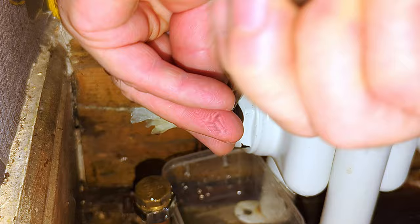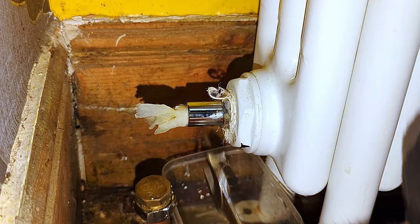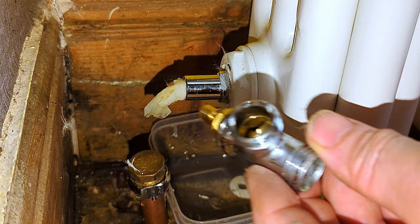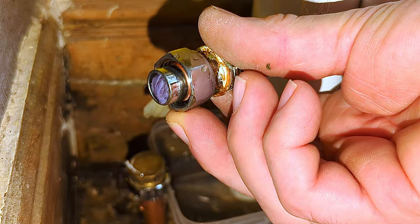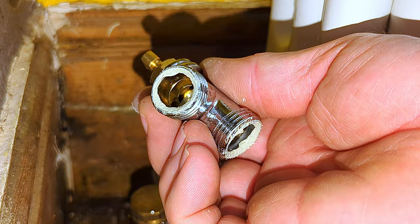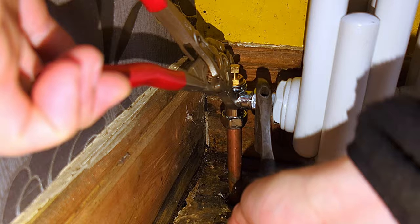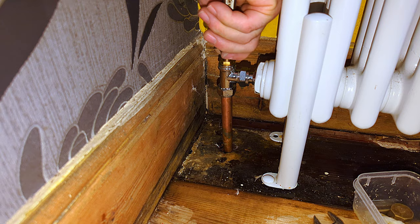I've got the new tail already wrapped with cord and inserted into the radiator — now I've got to do it up. I want to make sure this goes really nice and tight. You can see I've got a little bit of kitchen paper in the end of the tail to stop water running out, and I'm pushing down really hard on that spanner so I know this fitting is going really tight — exactly what I want. A little bit of cord has come out, so I trim that off with my blade. I noticed the previous plumber had only put joint compound on the bottom joint and not the top joint. I always use joining compound or PTFE tape on both seatings of a compression fitting. I pop the new olive and nut on with joining compound on both seatings, push it onto the radiator, do up both nuts finger tight, then support the radiator valve and do up both nuts properly. Then I open up the valve, put the cap on, open the thermostat on the other side — job done.